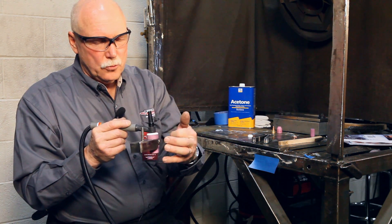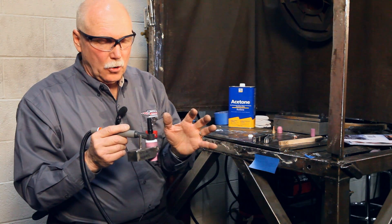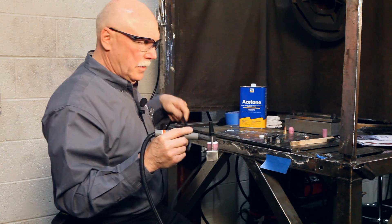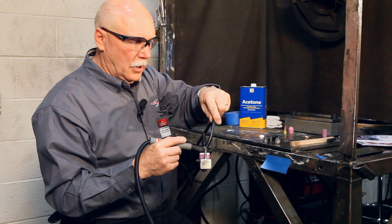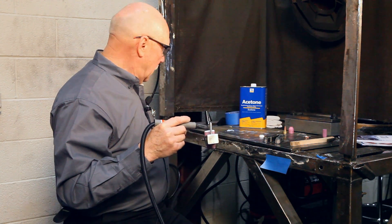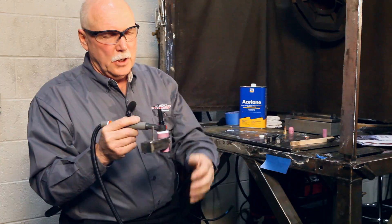This gives you additional trail purging, and they're very useful — they allow you to make longer, more continuous welds. You pick a gas hose from a purge line, put it onto your trailing purge cup, and now you not only have argon shielding gas from your torch, you also have argon shielding gas from the trailing purge.